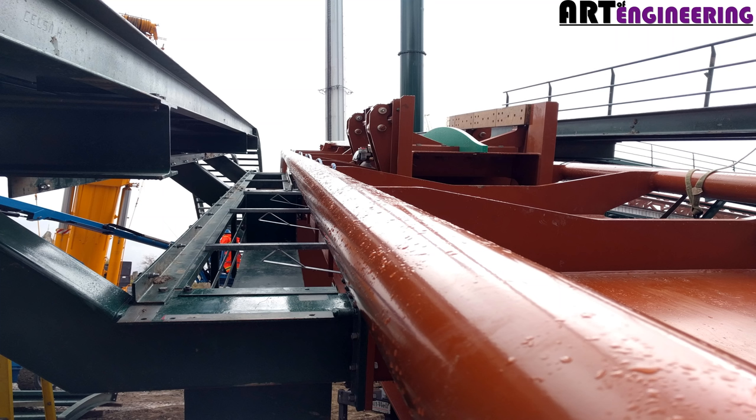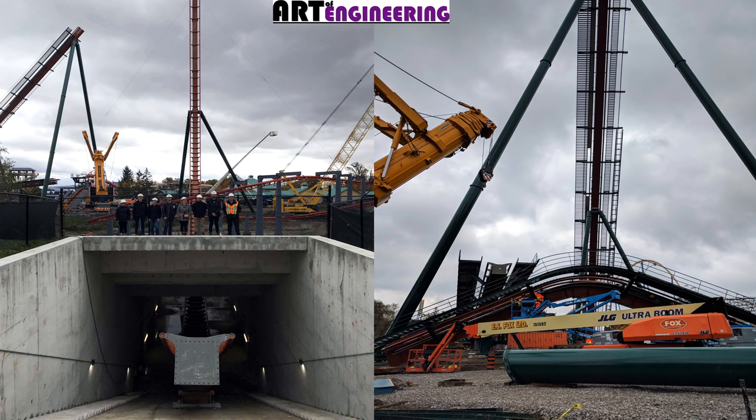The estimated cost for Yukon Striker is around $32 million. If you look at this photo here, you're going to see that little green part in between the brake there — it serves an interesting purpose. After the chain lift, the train passes through that piece and the chain dog lifts up as it passes over the green fin. There's a sensor that makes sure the chain dog drops back down into place. If it doesn't, the train will be stopped and won't move to the drop chain. This is just for safety measures and it helps relieve some of the stress from the chain dog.